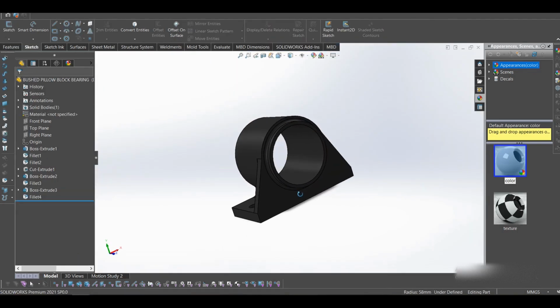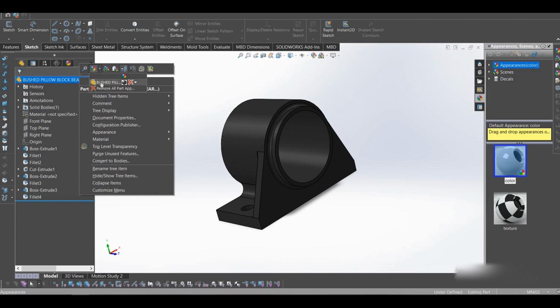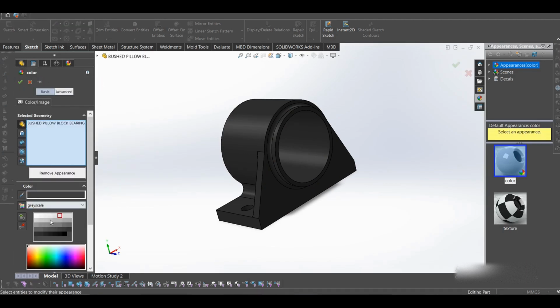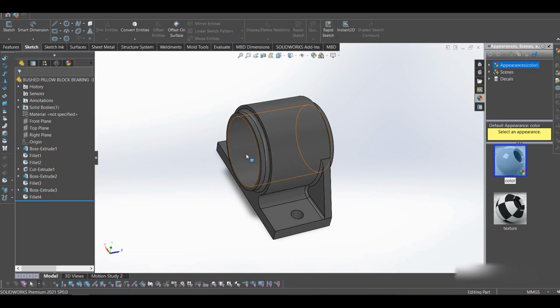The kind of bearings here, this is just a simple model to show you how everything looks. Basically, since these bearings don't really undergo a lot of motion, it's just a swing. It doesn't go through continuous motion, so you don't need roller bearings. You just have a simple bush bearing, which will work very well.